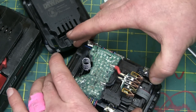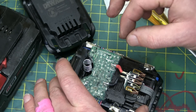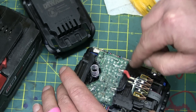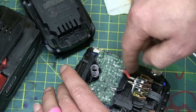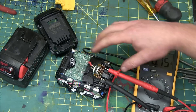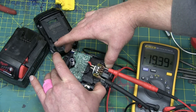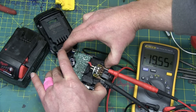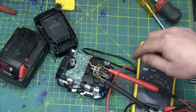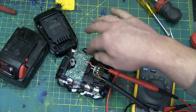There's no snap-action contact — that means it's just a sensing contact that's not actually switching the batteries. It would be this guy that has some MOSFETs, some electronic switches, that would tell it to enable the 60 volts. We've got the probes wired into the terminal receptacle and turn this on — and nothing happens. So there's clearly some electronics in there that need to see a tool attached before it allows this to be 60 volts.